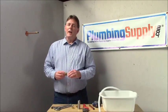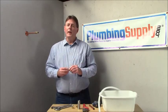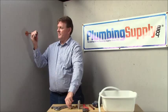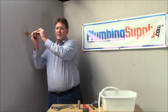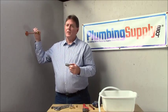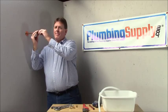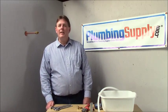They make all different kinds of compression fittings and adapters that go to different kinds of piping. If you want to go to an iron pipe size thread, they make fittings that will still attach onto a compression fitting. If you're going to use iron pipe thread, you do have to use Teflon tape on that part — never on the compression side, but you do want to use it on the pipe thread. We hope we've helped you understand how to use compression fittings. I'm Mike from ThePlumbingSupply.com — thank you for watching.